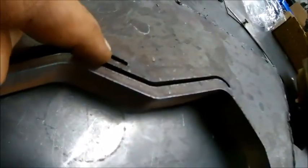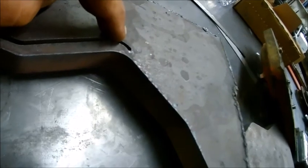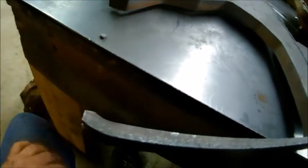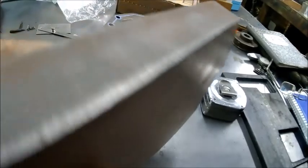Pretty good at five inches a minute. Of course we had troubles - our program puked out twice on us. Got there the first time, the second time, got all the way around the third time. Then we used the straight-line function to line it up and set the direction and speed, and made that final cut. Kind of unsuccessful but kind of successful - I never thought it would cut one-inch plate. Totally surprised, pretty nice cut quality. It's got a taper but that's way better than if I tried to burn that out by hand - it would have looked like a lightning bolt edge.